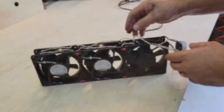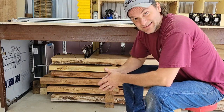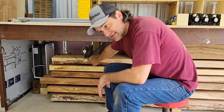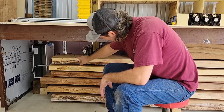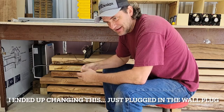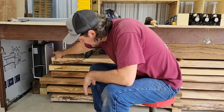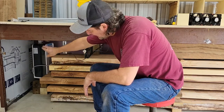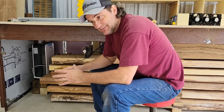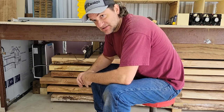I've got all the wood cut and stacked in here. I've got the little fans wired into my temperature controller, which is pretty much going to run all the time but at least I have some control. I've also got my little dehumidifier over here — I popped a hole out the side and ran it into a bucket so I can keep track of how much moisture I'm taking out each day to track how much I'm getting out of the wood.